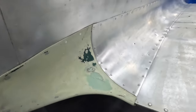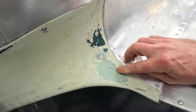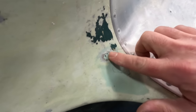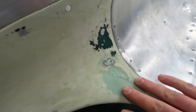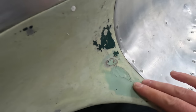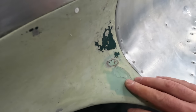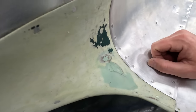So today we're going to be tackling some of the Bondo issues, and we have a fiberglass issue here. I'm going to remove a bunch of material, enough to get two layers of fiberglass mat across this area. Whatever cracks are left, I'm going to grind them out as well, so we get resin down in there real deep.